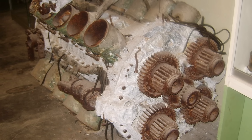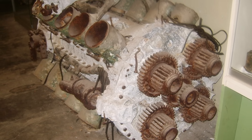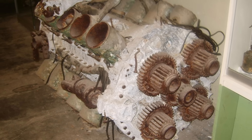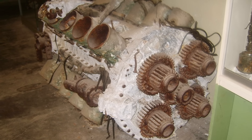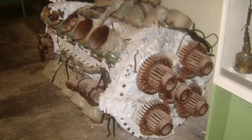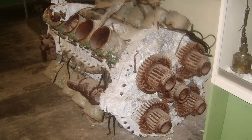When viewed from the rear of the engine, the upper right cylinder bank was labeled the A bank, with the designation continuing counterclockwise. The master rod controlled the D bank, positioned at the lower right. At the front of the engine, a spur gear on the crankshaft connected to four compound lay shafts, which in turn drove the propeller shaft. This gear reduction system slowed the propeller speed to about 35% of the crankshaft speed, while keeping it aligned with the engine's centerline.